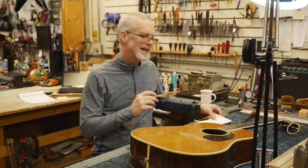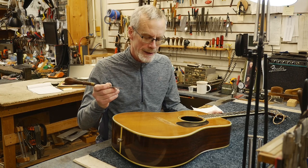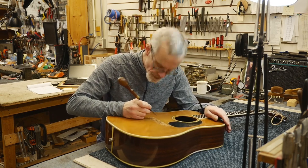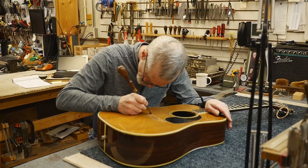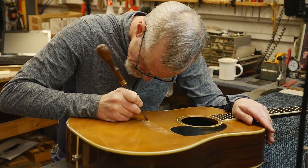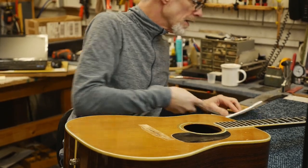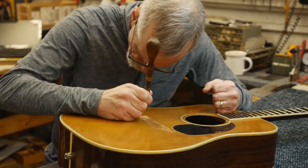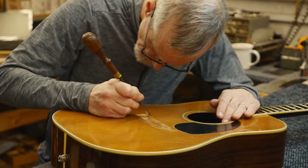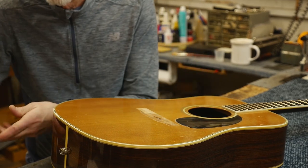I look literally like watching paint dry. Now I've got my three-quarter inch wide chisel with a nice square end on it. I'm going to use that to scrape off that stripper which has started to react with the glue and really do its job. This also allows me to come straight up right to that scribed line. I'm going to remove that gunk. I can go with the grain, against the grain, across the grain, because I'm really just trying to grab that top surface where all the glue is.